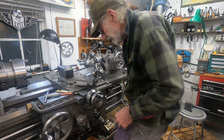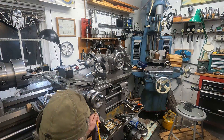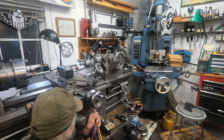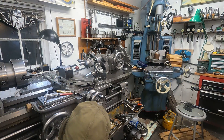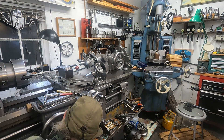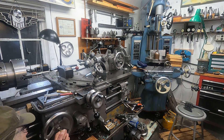Not even partially done. We've got to get the axle, and then over here are the clutches. That's the longitudinal clutch — give that a really good shot. The cross feed clutch — give that a triple shot. The cross feed is kind of a weak part on an early Axelson; they vastly improved that later. So I'm just going to flood that with oil and it just goes down into the apron. Right here is a hidden one, and right in the center of the hand wheel — this is all needle bearing. There are five needle bearings in this hand wheel.